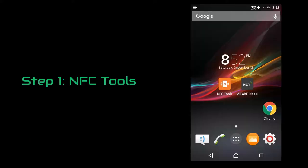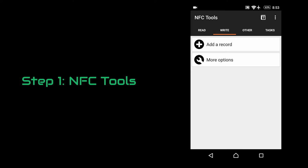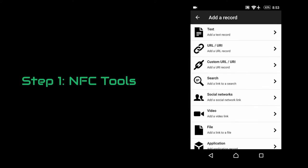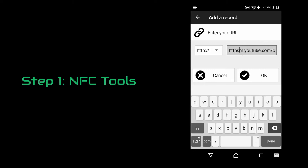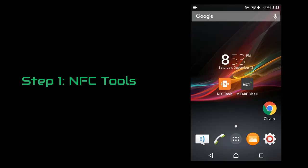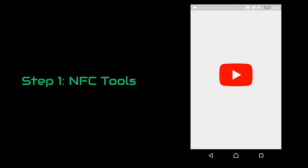First, I open up NFC Tools. Inside that, I go to the write option and choose to add a record. There, as you can see, we have a lot of options. But for our use case, I choose URL and paste my channel URL in it. Then I hit OK and tap write. When I tap my tag to the phone, voila, it wrote the URL to the tag. And once I quit the application and tapped my tag once again, it opens up the URL, which is really cool. But how does it look as data?